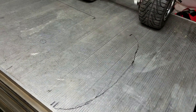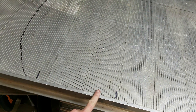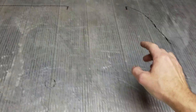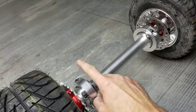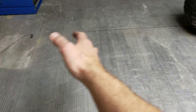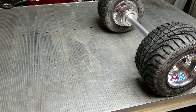What I did here is I took a Sharpie marker and traced out the outline of the Mini Model S on my aluminum work table. This is the wheel well opening, and I did my best to mark where the inside edge of the body would be, so I know where to lay out the axles and what the limit of the frame would be. There's where the rear axle will be, and here are the bearing carriers. I'll begin cutting and welding together the frame that will ultimately weld to these bearing carriers. Once the basic frame is welded together, I can start on the front axle assembly and continue building from there.